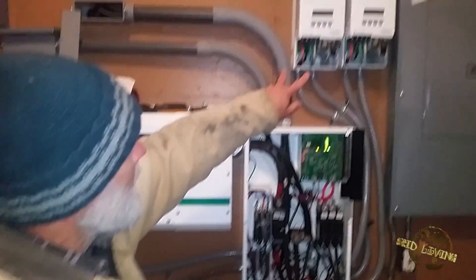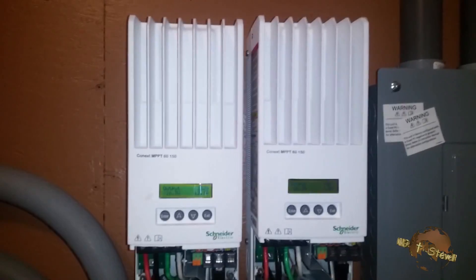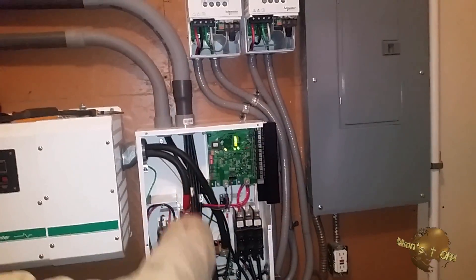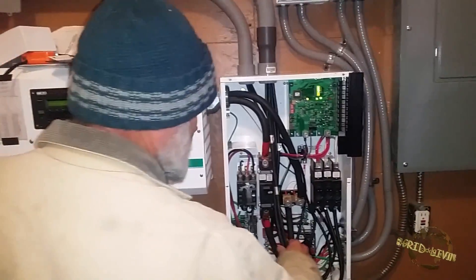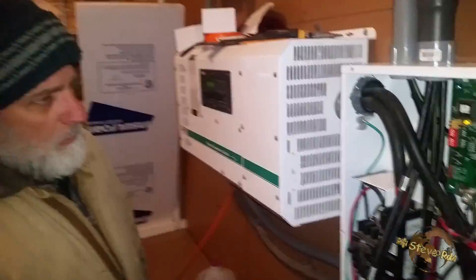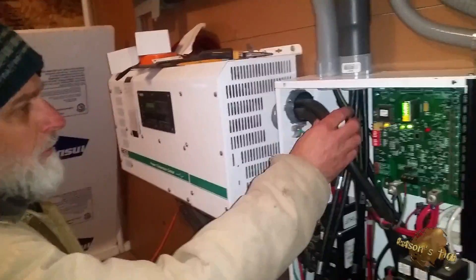I got these as an upgrade and replaced one for one. Now I'm using two MPPT controllers hooked in place of the PWMs, and they go through completely different systems. I've got two main arrays out there. They use separate wires, come in on separate circuit breakers, and go to separate charge controllers.